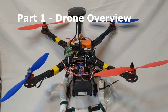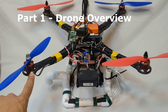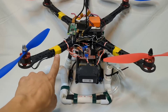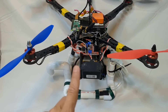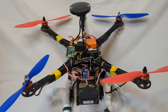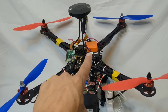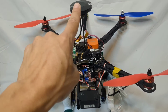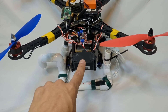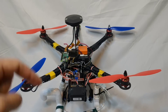Let's start with an overview of the drone. It's an S500 kit for the frame, a 920 kV set of motors, 30-amp ESCs, and a 4S LiPo battery down below — all very standard for a drone of this size. The more interesting electronics are a Cube Orange autopilot, a HERE-3 GPS, and a downward-facing TF Mini LiDAR. Together, these things enable precision drone flight.